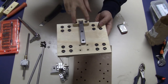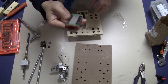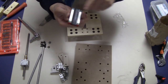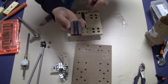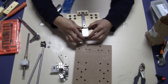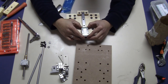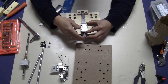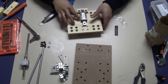Now I have the stopper and rail installed on this plate. Next step is to slide the bearing block on. Always remember to keep the plastic piece on when you're not having it on the rail, because if you don't, all the balls will run all over the place and it's really hard to put them back. To put the bearing block on, just line up the plastic piece with the rail and push it in — the rail will push the plastic piece out by itself.